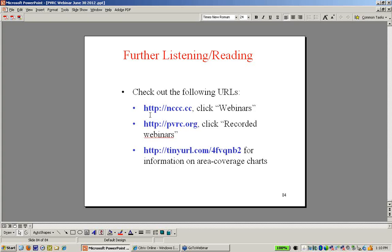I would, frankly, if you're trying to emphasize certain positions, put up a wire 2-element Yagi, and you'll gain some forward gain, and you'll gain some rejection of signals off the back, so that'll help you receive. And then when you want to work another part of the world, you put up another dipole with a reflector on it.